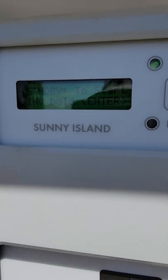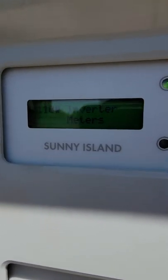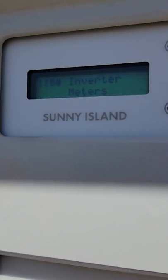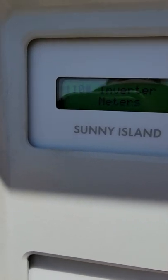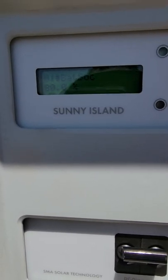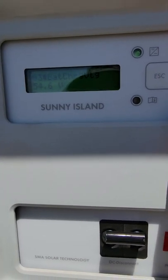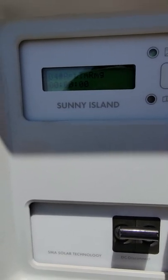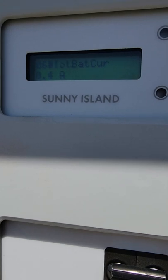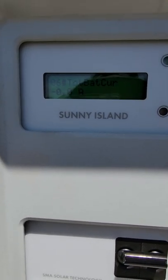Now I'll show you how we know we got it right. Come over to the Sunny Island, hit the down arrow to Meters which is menu 100, then go down to number 120 which is Battery Meters, go in, and scroll down. You see battery state of charge — currently 80% — battery voltage, battery charge, time remaining to float, and then number six: Total Battery Current. I never really understood what that meant before, but I'm going to show you how that number is going to be useful in a moment.